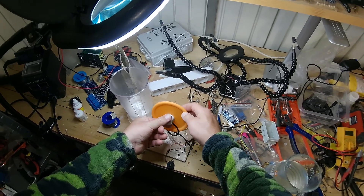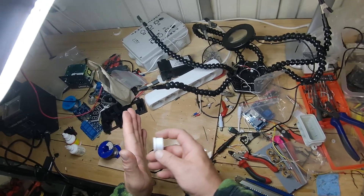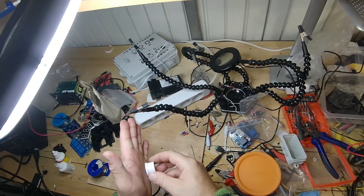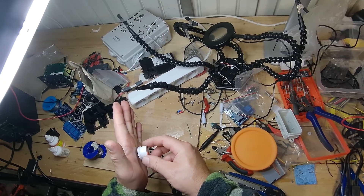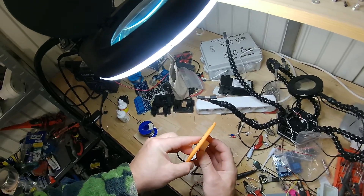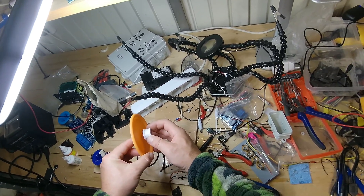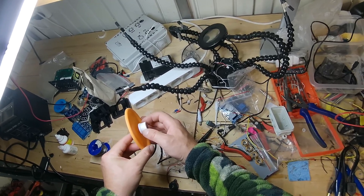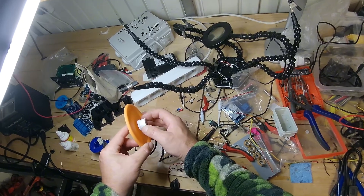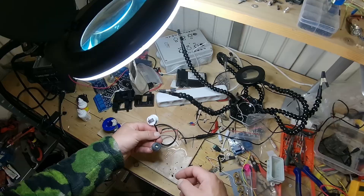Plastic is OK. One important thing: there cannot be an air space between the tank surface and the sensor — the sensor must fully touch the surface of the tank. If we have air space, it acts as insulation and the sensor will not work. With full contact it works perfectly.